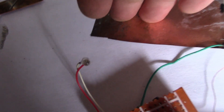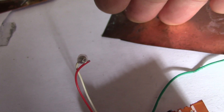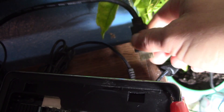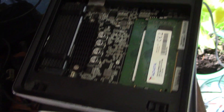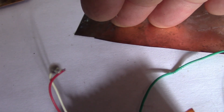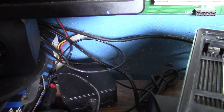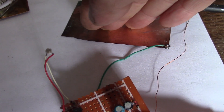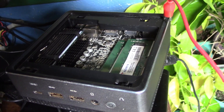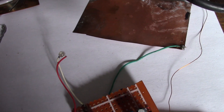Press it - yes, yes, we still get light. So next I'll take out the HDMI lead. Let's get rid of that - it's absolutely disconnected completely now. There's absolutely nothing. Does it still work? I wouldn't think so. And there we are - that's been the cause. It's been coming through the monitor. Even though the monitor's switched off, it's still got its little blue light on. So evidently something's coming through, going through to the case of the PC - that's what's being picked up, and that's what's been enabling this to scavenge some energy and do its energy harvesting.